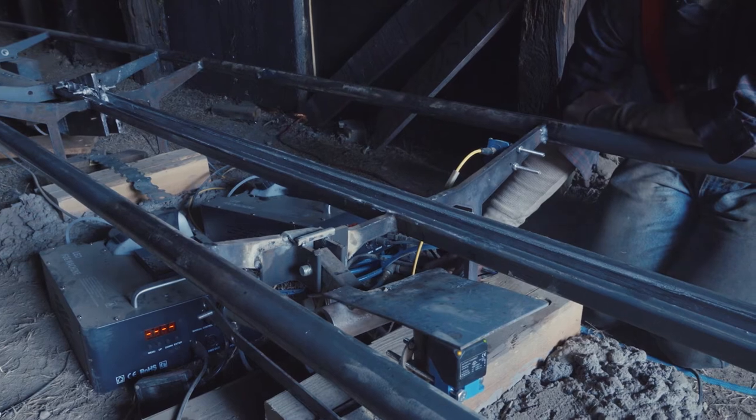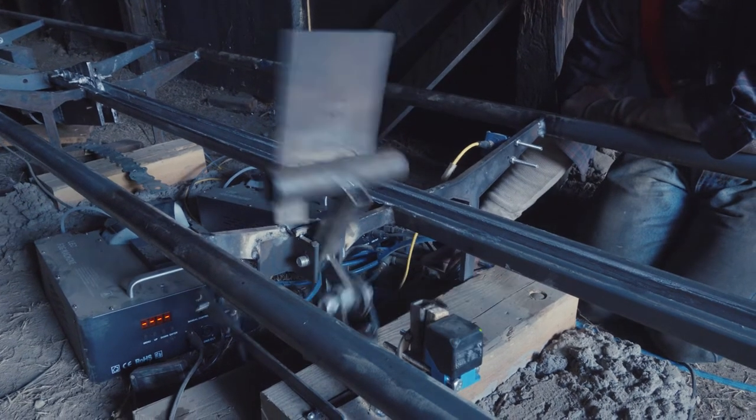Our system always needs to be pressurized because our brakes rely on air. So one of the gauges is just monitoring, hey, is there air in the system? That can shut down the entire system. It's communicating with the PLC constantly. And if at any time the compressor stopped working or there was a hole in the system and we lost pressure, the whole system would shut down.